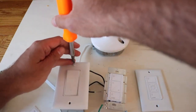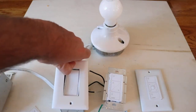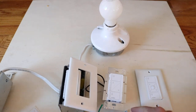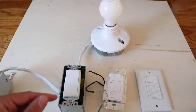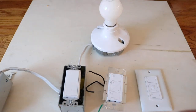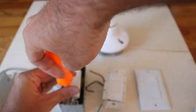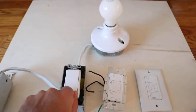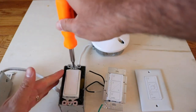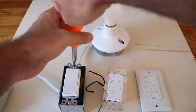This is literally the easiest way to wire a three-way switch. You can install it where you already have a three-way switch, or in places where you don't have one at all and don't want to cut holes in your wall to run wiring. You can even make it a three- or four-way switch by adding additional remotes. To begin, remove the cover plate on the existing light switch, then remove the screws holding it to the junction box — make sure the power is off before working with electricity.